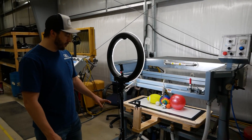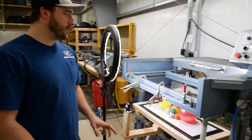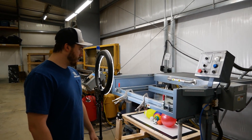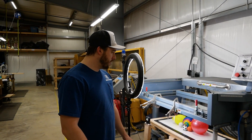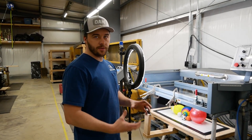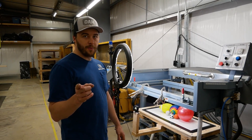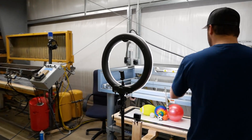We're filming the whole process. On this first one we pull the heating elements forward and turn them on — it's about two to three minutes to get up to temperature. We've got a temp gun to check the surface and make sure we're right where we need to be. We'll probably go to about 300°F — that's usually warm enough that we don't have too much resistance, but not so warm that it gets super thin and we have blowout worries. Someone jokes we could make cookies on this — and that's actually on the to-do list.